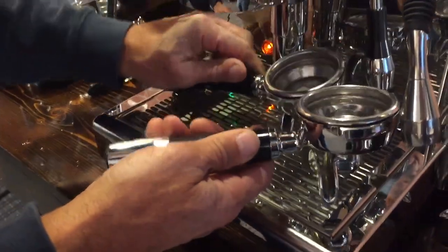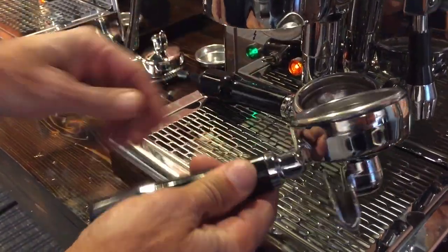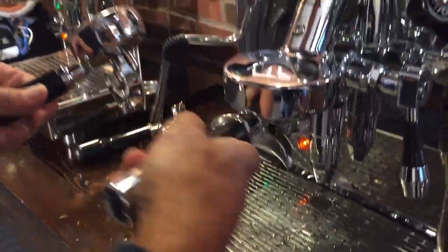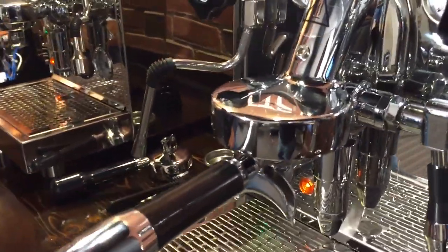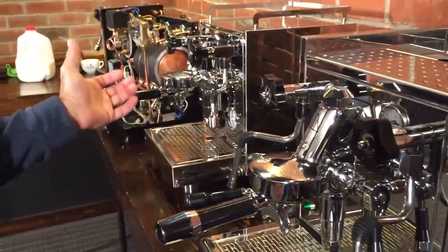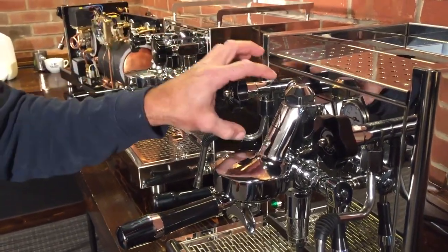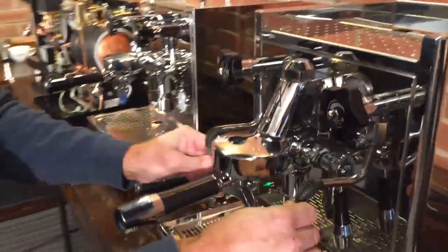Look at the difference in the handles. I do like the feel on this handle — not like you're going to get carpal tunnel using either one, but it looks nice and feels good too. This handle is also very well done. Most steam valves are high quality; they're the sprung style, so they'll last for a long time. The valve seat is held and pushed with a spring, so you don't crank it in when you close it — you can't overdo it and start damaging the seat.